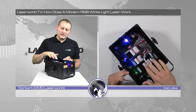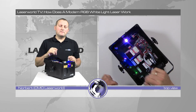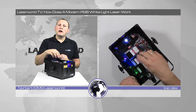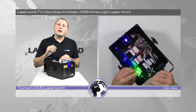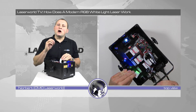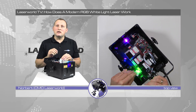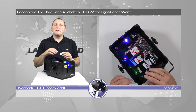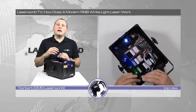We have the different laser sources — you see the green source, the blue source, and the red source — and they have their certain driver electronics. Each laser color has specific electronics for driving and controlling the modulation of the laser. Modulation means the quick switching on and off and also the dimming — the control of the intensity of each color. That's how you can create all the different color shades with an analog modulated laser.